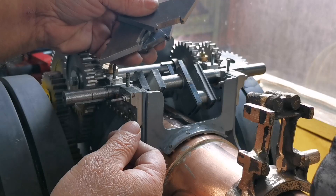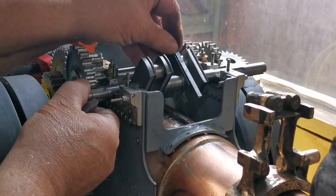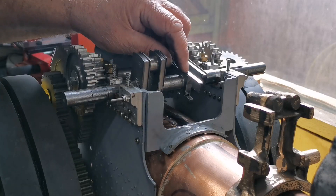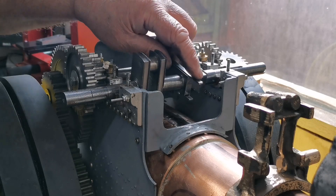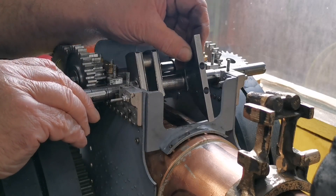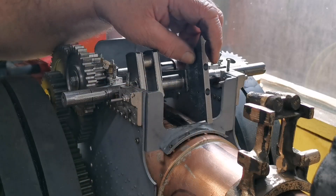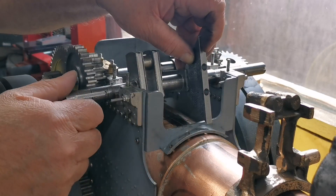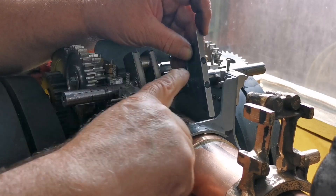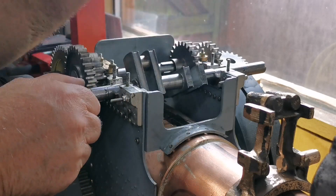Cut to the angle. Next thing is to trim the straps to length and then stick some studding on — long enough so when that is on there it can go through the weight, put a nut on, and tighten it up. Then when I've done that, I'll be mounting it in the dividing head so I can machine this part here to one and a half inch radius, the same as the top.